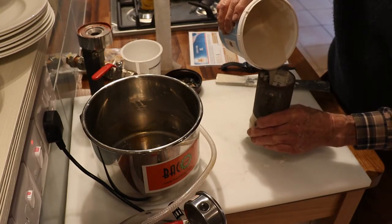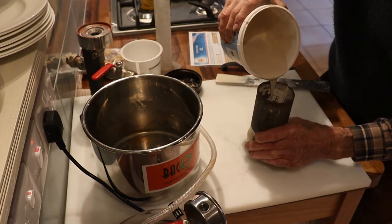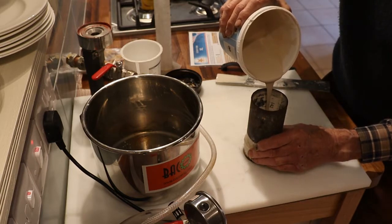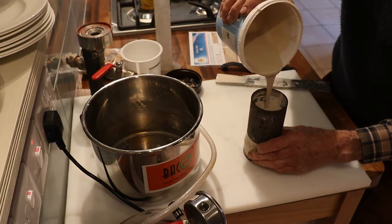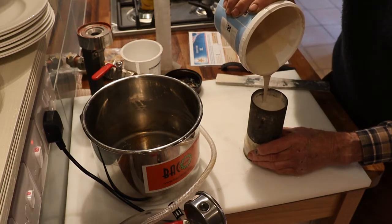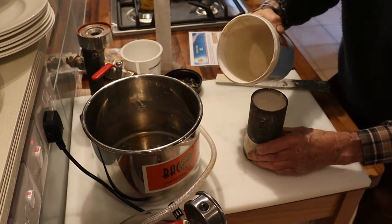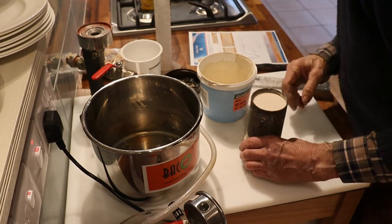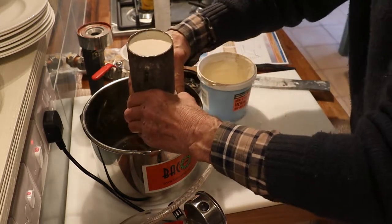You have to be careful with your waxes that you don't have any areas that trap air as the liquid level rises. So we'll go for about half an inch cover over the top of the peak of the thing to make sure it's strong enough. So that's about it. Right, so now we have to vacuum the flask for 2 minutes.